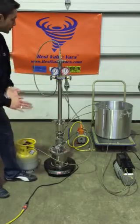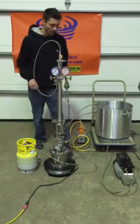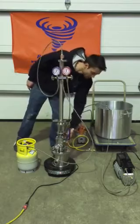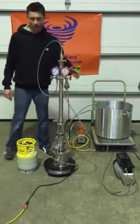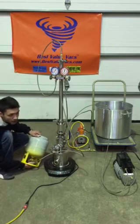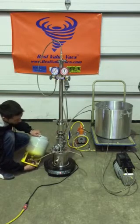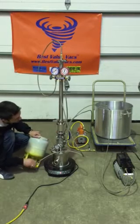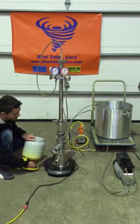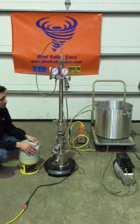I do have a sight glass down here that I'm using to monitor where my butane is. Everything's hooked up. The valve is open, the collection base is open — this is the only valve that's closed right now. I prefer to use the blue valve. The red valve is connected to a dip tube which holds the liquid. So I crank that on and you can see the butane flowing quite rapidly, like a deluge going down. I'll let it fill until it stops — in this tank I have about four cans of solvent.